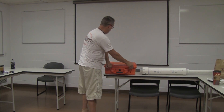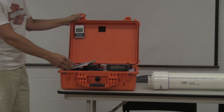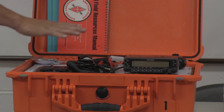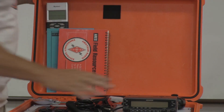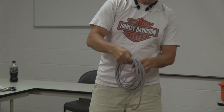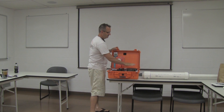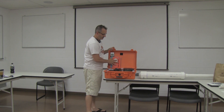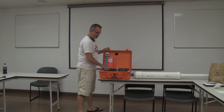We're going to have some training here on our GO kits. As you can see, we have five of them. When you open these things up, one of the important things is you want to look at how everything is laid out in your kit. This particular kit does not have coax laying in here — it's in the antenna tube. The other four do have coax, and the coax should always be rolled up in about a diameter like that. You don't want to get it too small, otherwise it gets bunched up and your lid won't close. The lid was critically measured to come really close to this, so we always want to make sure everything, like the books or anything, is available on this side. Otherwise it's going to put pressure on the radio. So always get an idea of how it's laid out so you can put it back.